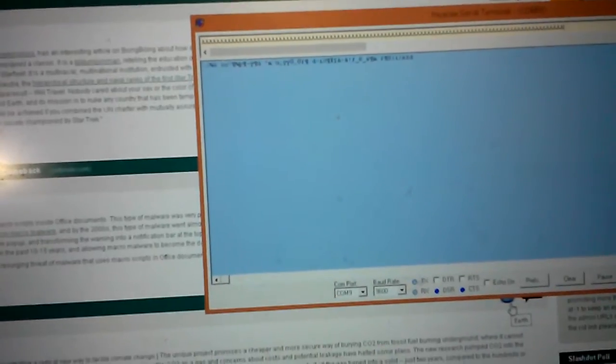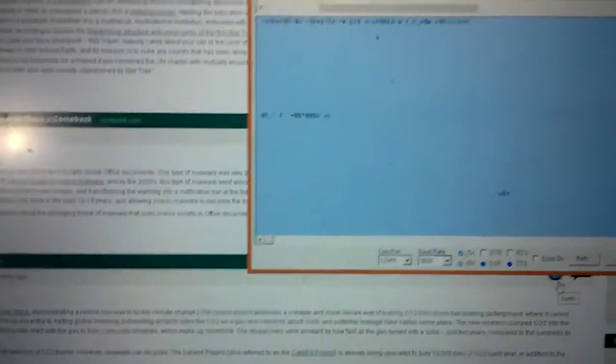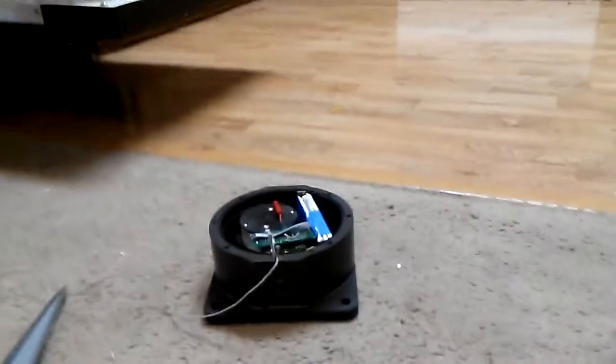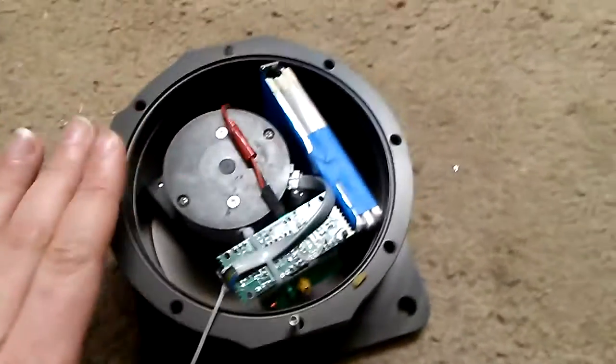And still a bunch of noise. And let's see if doing this actually gives me the output that I want. Looks like it. Yeah, what I basically did there is that right now I have shorted the 2 grounds using this screw here and this here, which we don't want, obviously. So this guy's gonna have to be mounted on a little cushion.